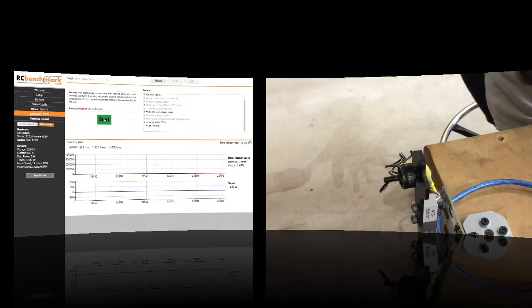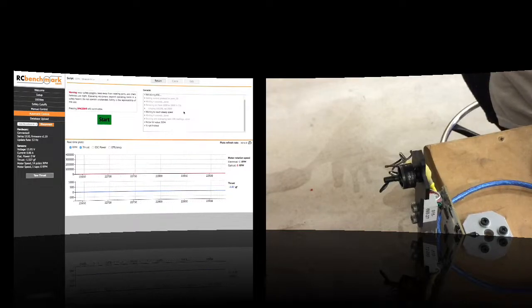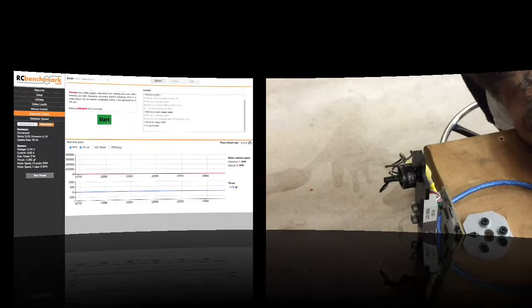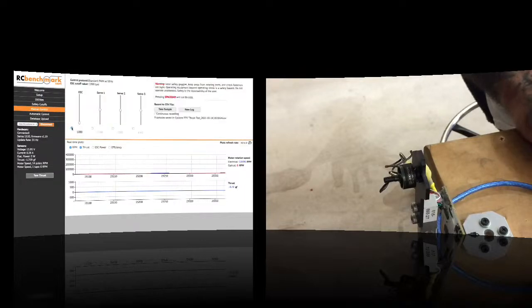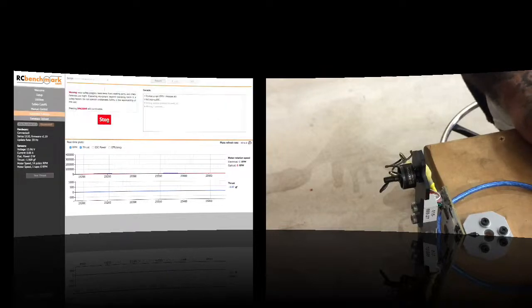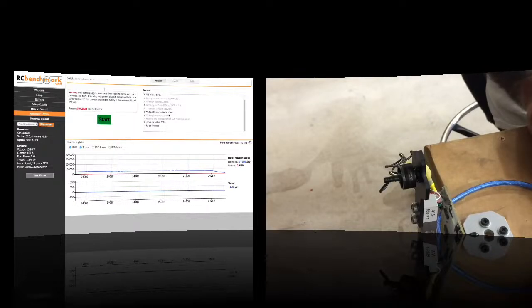All right. First reading is going to be 3,594. Now, time out a second. So, no, that's right, 3,594. This is a problem. Second reading. Let's do it again. The battery being low doesn't affect the KV reading because it adjusts. If you have 1 volt, it should spin at 3,800. If you have 15 volts, that's not going to affect it. So that's why I'm not worried about it. It would affect thrust and stuff, but it won't affect the KV reading. Okay, 3,588.